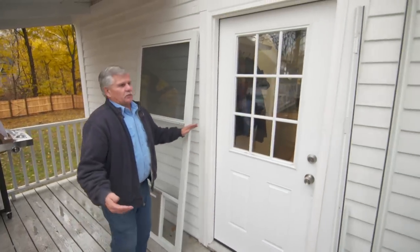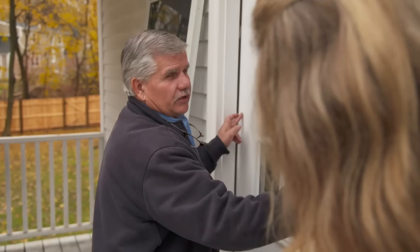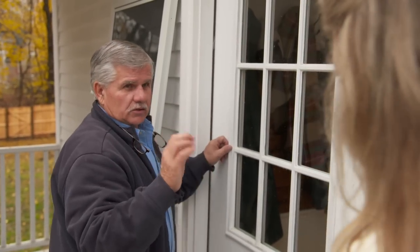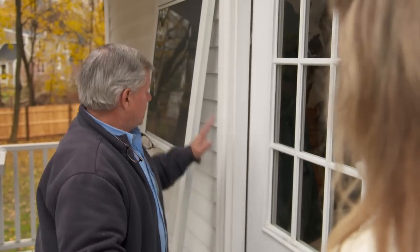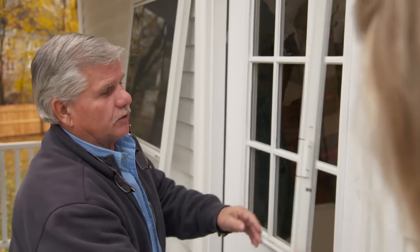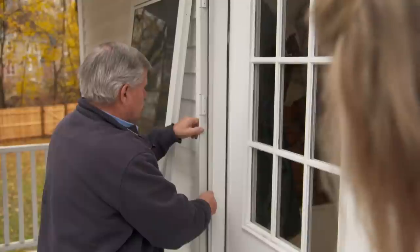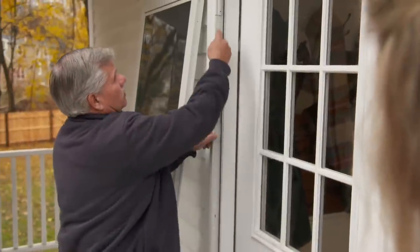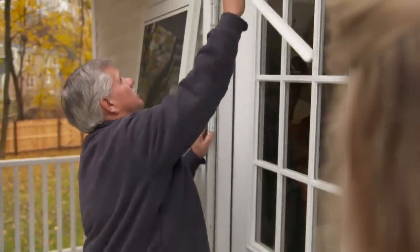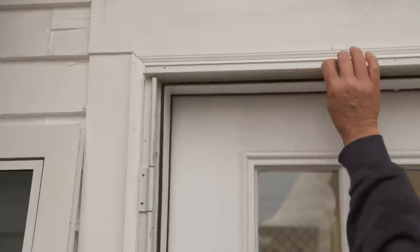Ordering this door is pretty simple. I ordered the size of your door — you have a 3068, which means three feet no inches by six foot eight inches high, and that's what we have for the storm door. To install it, it's pretty straightforward. They supply the weather stripping jambs that will go on the side against your existing jambs. Hinges are already mounted. Across the top and down the other side we have another jamb. There's also a weather strip and we'll just screw those in place and hang your door.